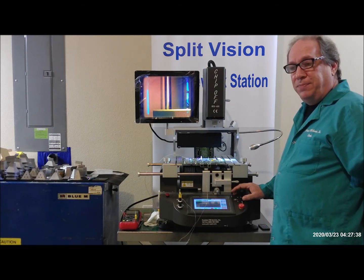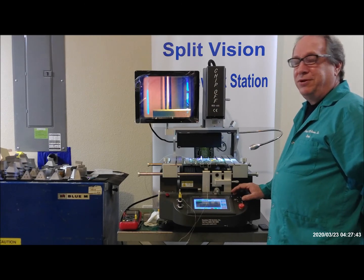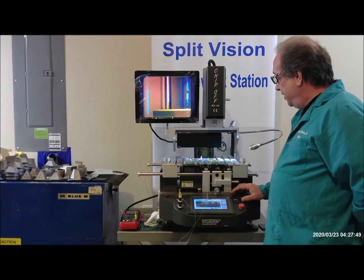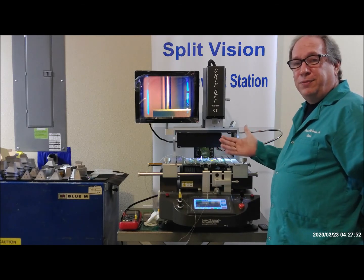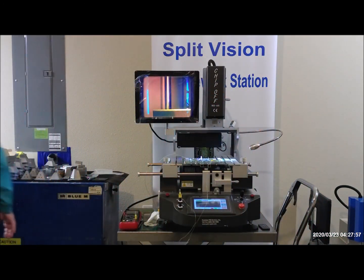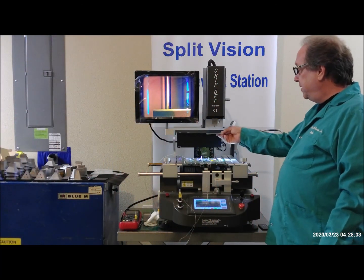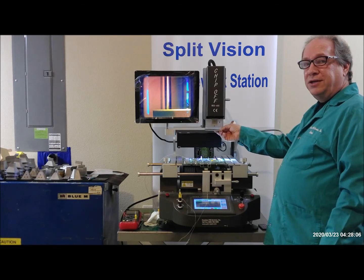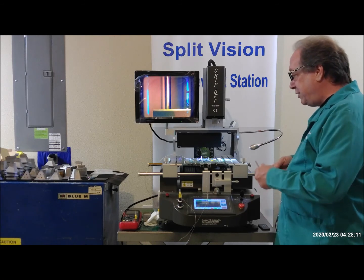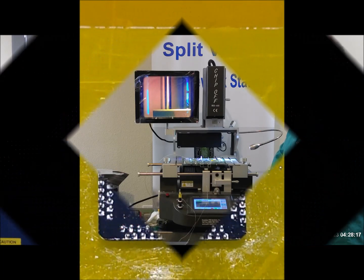Since this particular component does have a ground pad in the middle, we're going to need a higher temperature on the perimeter to get that to melt. This profile looks like it's dialed in now, and the cooling fan's hooked up. Wait for it to cool off. And basically, we're going to get our little plate here. And what we'll do is we'll put this on the component, push up on it, and that turns the vacuum off and releases the chip on the plate. So that's our removal process. And then next video, we will do the installation process.